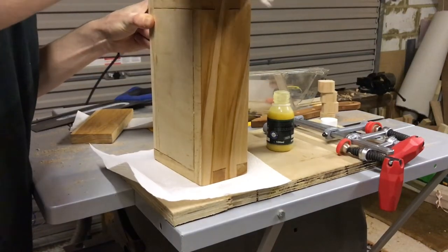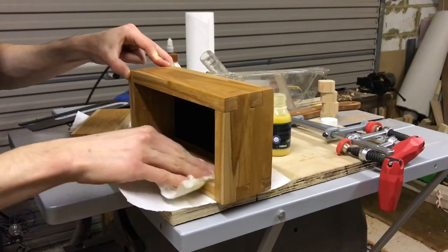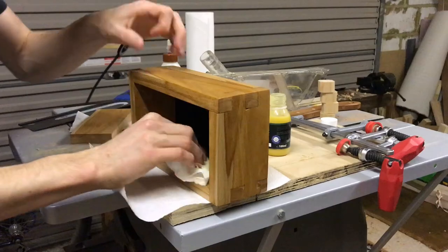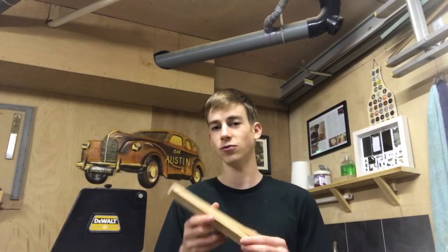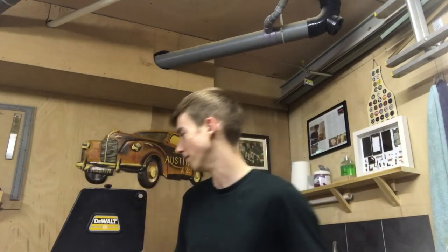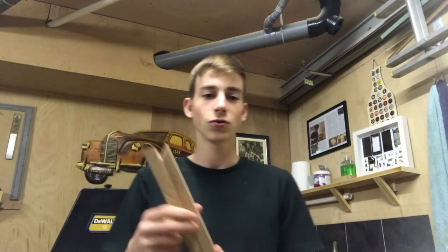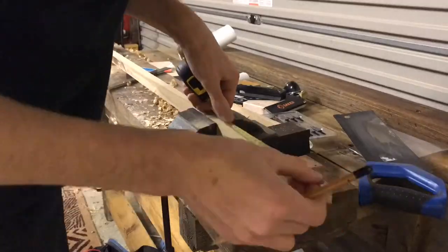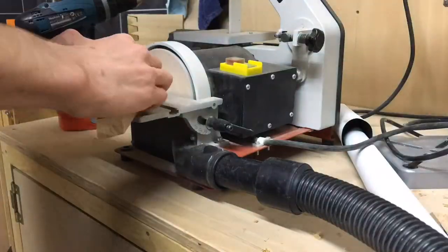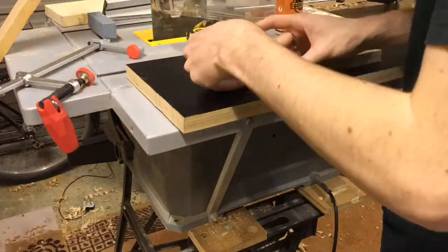Actually no reason why I can't do the inside now — then it can all dry. I then cut some thin bits of the beech which would create a frame which I could sit the ash into. I've been having a think about how to do the lid for this box. What I've decided to do is a mitre-jointed lid with an inset panel. First we're cutting the mitre to make the frame. The box itself is 19mm thick, so these pieces needed to be 19mm thick — I ripped them on the table saw, just ripped a long strip. I've cut the mitres on the ends so I've got the two sides and I need to cut the two other panels. I then cut out the frame adding mitres onto each corner to produce a nice all-round finish, sanded the 45 degrees on the sander to produce a nice crisp edge, then glued it up, clamped it and got the ash ready for burning.